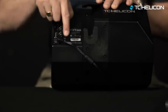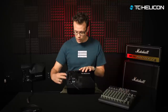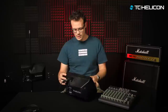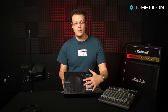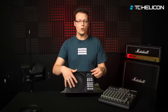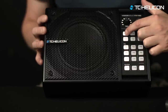So that's essentially hooking it up. You've got one more little input down here — a little aux input. That's going to be your eighth-inch stereo input for things like your phone or MP3 player. Now imagine you've connected your mic for the most simple setup — I'm just plugging in a single microphone. The first thing you're going to want to do is make sure your master volume is turned all the way down. This is the volume of the speaker — it doesn't affect the level that goes out to your mixer. So if I'm connecting a cable from this unit to the mixer going out to a PA, the master here doesn't affect that level at all.